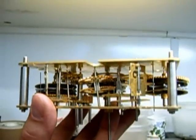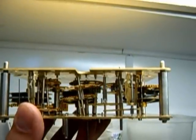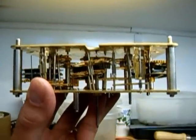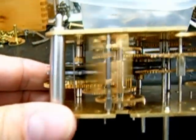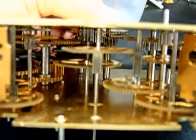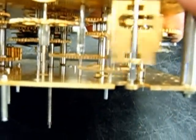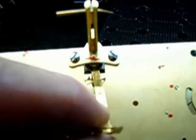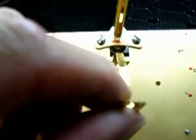Here's the time when you're probably going to say to yourself, oh my God, how do I get all these pivots in there? They're all leaning and laying all over the place. Try to put the bottom plate where the winding arbors are in first, then put the little nuts on them just very loosely, and then work your way upwards into the smaller pivots. It took about five minutes and I was able to get all of the pivots in where they live. There seems to be quite a bit of resistance in its moving, so we know the pivots are nicely polished but now we're looking at the holes themselves. I went ahead and installed the pendulum post with the escape wheel — this gives me the verge and the crutch — and the rear pivot has a lot of play in it.